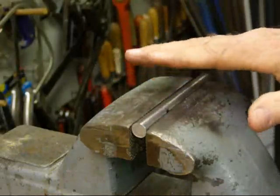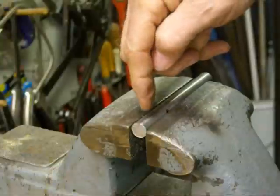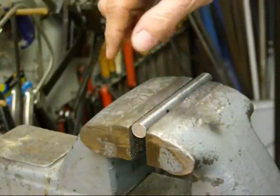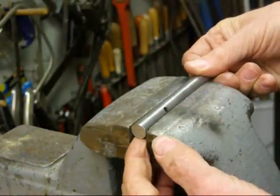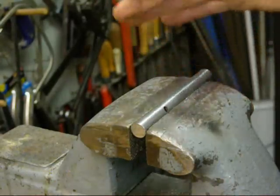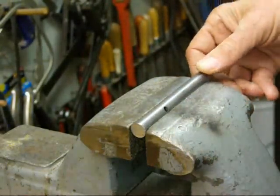The same thing applies if you're doing it in the drill press vise. What you'll notice is that the drill bit will skate off to the side and find its own center. If you have not drilled very far in, you can sometimes correct it by rotating the stock slightly and recentering it. Not a great method, but with enough experience I think you'll find that to be moderately successful.